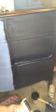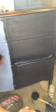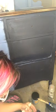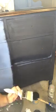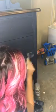So, okay, with the dry brushing, I picked a lighter color. My son is spraying me with a spray bottle. I like to use chip brushes for dry brushing. It's my preference. And so what you're going to do with dry brushing, we're going to open this. This just gives it kind of a cool look. You don't need a lot with dry brushing, hence dry brushing. So I'm going to just dip it in there a little bit, and I'm actually going to take that off. So you just need a little tiny bit. And then I'm going to go over here, and I just want to dry brush the corners. So I'm just going to take this, and it's almost like a flick, okay? You see the dry brushing, you get a lot of the streakiness.